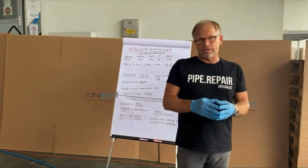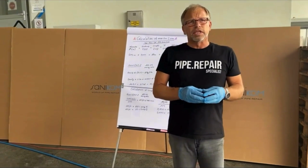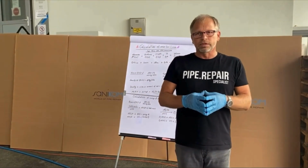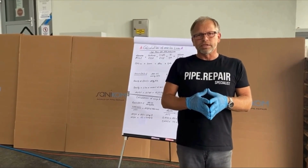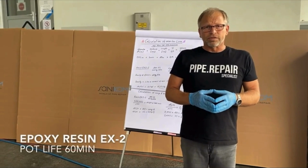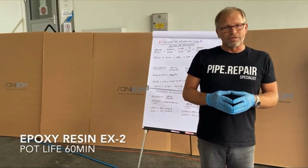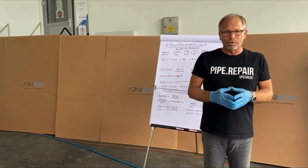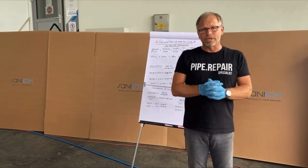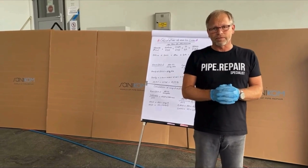This short curing time means, for example, EX2 resin has a pot life of about 60 to 70 minutes, and the curing time 45 to 50 minutes with steam, so with 70 to 80 degrees steam. You see, very fast, with a very long pot life. That means big safety on site, enough time to work with. Even with higher temperatures, it is still relaxed in its reaction.